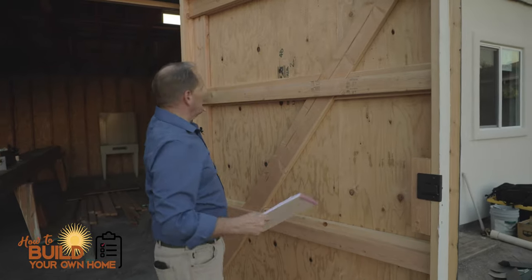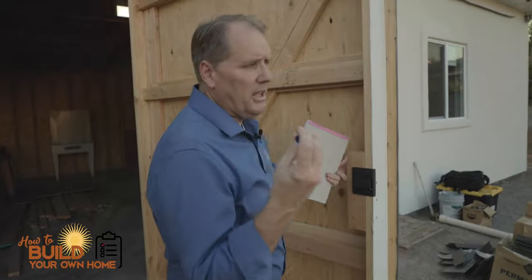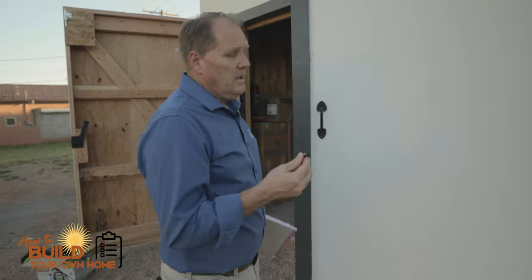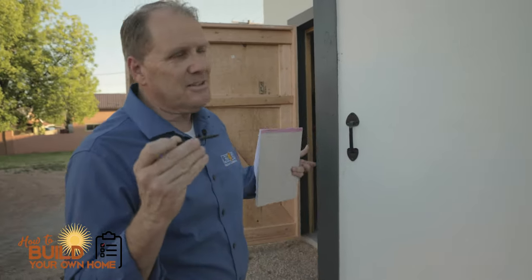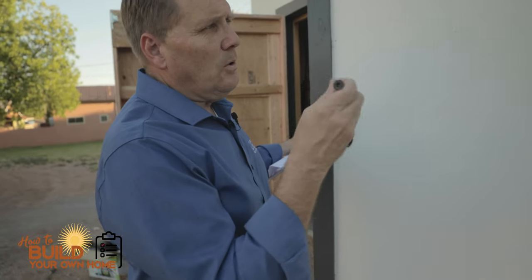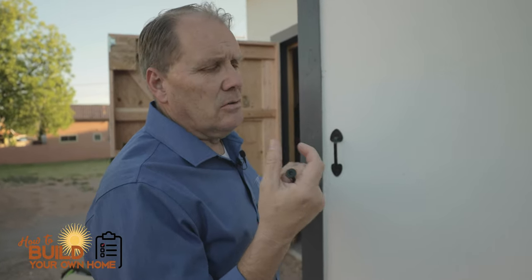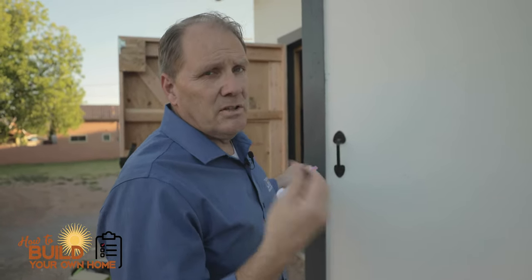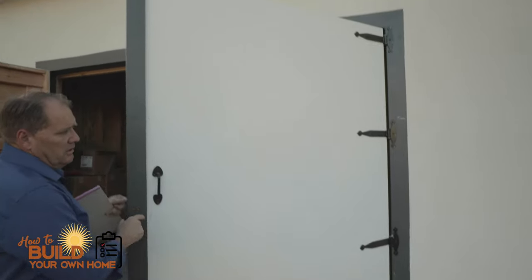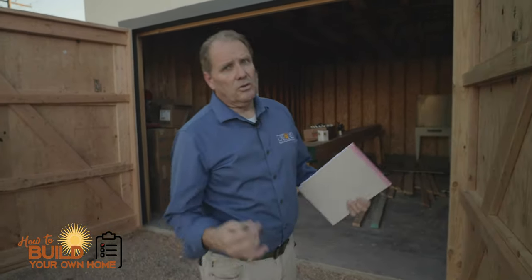The rest of it's all cut in piece and filling it in, and one of the tricks is making sure you get some hinges that can handle quite a bit of weight. I ended up putting four hinges on this door, and I took some extra long lag screws because I need some extra support, going all the way into the stud work. A lot of times the screws they give you with hinges are really small, so I put one extra long lag screw on each hinge, and each one of those hinges can handle at least 175 pounds — so four of those gives you a really strong door.